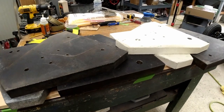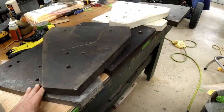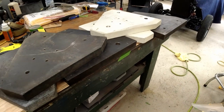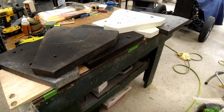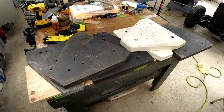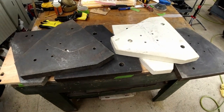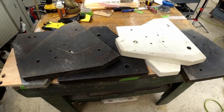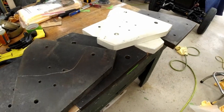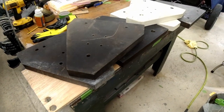The plates are maybe 125-150 pounds each. With four of them that's about 600-700 pounds. I know that's nothing compared to a vacuum press, but it's what I have and I want to get this done. I could buy a vacuum bag and pump just to do the dash, and I will if I have adhesion issues. But honestly, using polyurethane glue, I've glued things together by accident that I couldn't get apart — so following directions should result in a good bond.